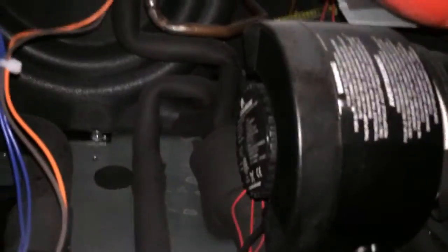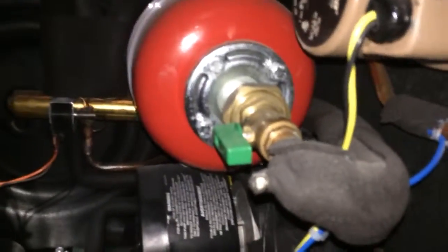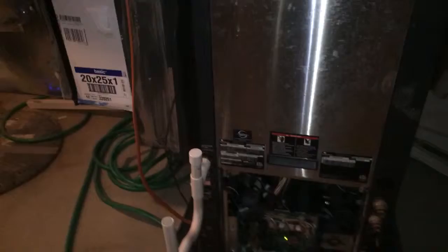All have built-in variable speed flow centers, each one individually. They put expansion tanks in them. Just doing the startups to get them running. Pretty big house. Three of these systems will have damper control systems, so only a few package units are up and running out front.